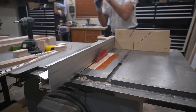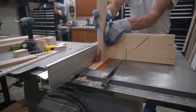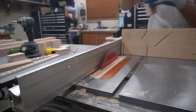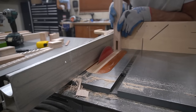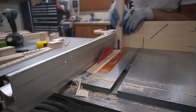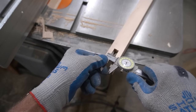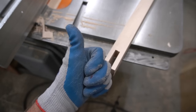After cutting the side pieces to their finished length of 32 and a half inches, I use an auxiliary fence on a miter guide to cut slot mortises a half inch wide and around two inches deep in multiple passes — centering the mortise up in the piece and checking the final slot width with a fractional dial caliper to verify the width.